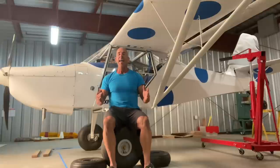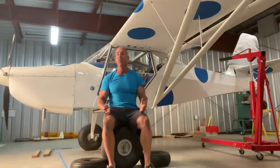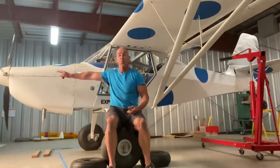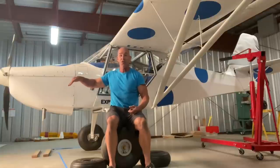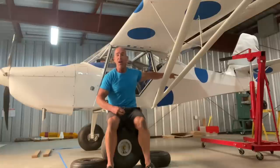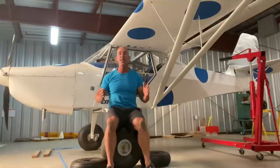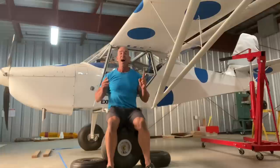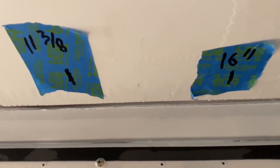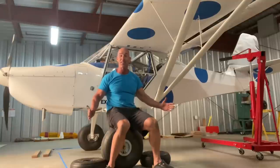In this video, we're going to do the very critical center of gravity measurements. I have 800 pounds of kettlebells, literally. If I put them in the cockpit with me, I'd be fine — the plane would fly correctly. But most everyone would guess that if I put 800 pounds of kettlebells in the nose, the plane's going to crash. The nose will never be able to get up; it'll just go down the runway dragging its nose. Similarly, if I put 800 pounds of kettlebells on the tail, the tail would go down, the nose would go up, and the plane would crash. The weight has to be in a very specific place, and that's what all the wind tunnel testing determines. I know that on this airplane — see these pieces of tape here? — if the center of gravity is between these two pieces of tape, it'll fly great. If it's not, I crash. So you make sure the center of gravity is between those two pieces of tape.